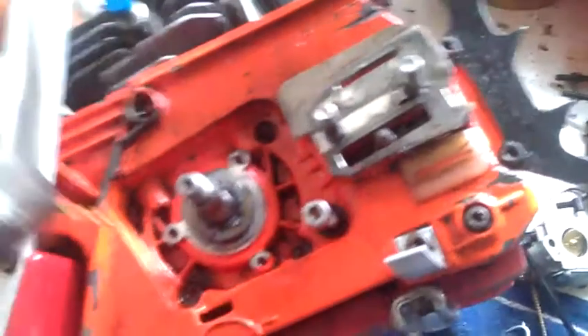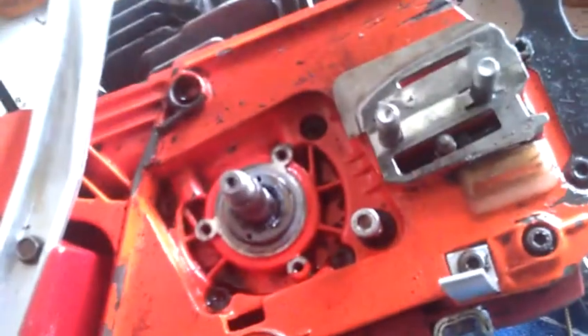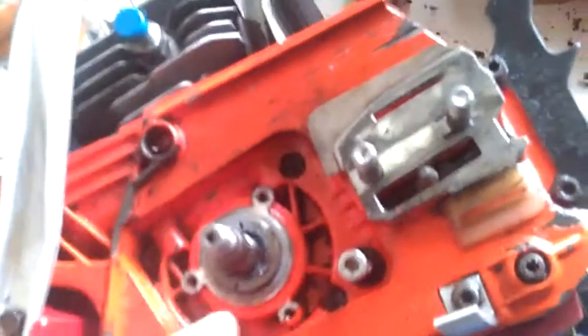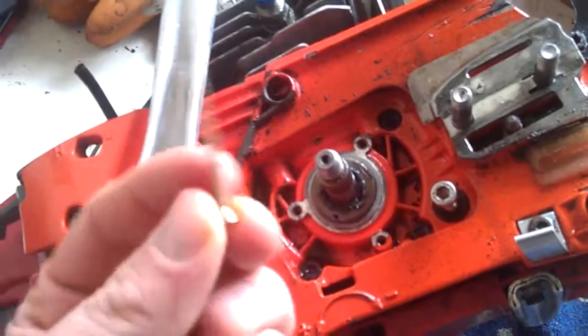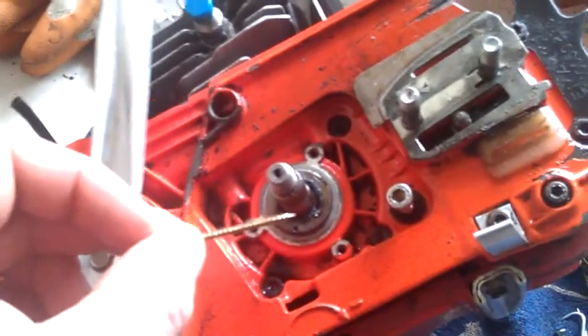Drill very carefully through either side. I wouldn't fancy doing it with an electric drill. It doesn't take long even with a rudimentary setup — just drill through either side carefully. Keyword: careful. As soon as it's through, stop and withdraw. Then use a couple of whatever crappy screws you have knocking about — these are just plasterboard screws. As long as you can get the tip in. The key is it's better to use screws that are slightly too wide.